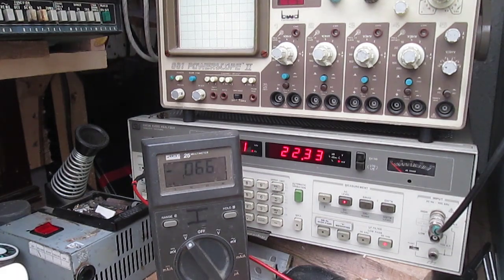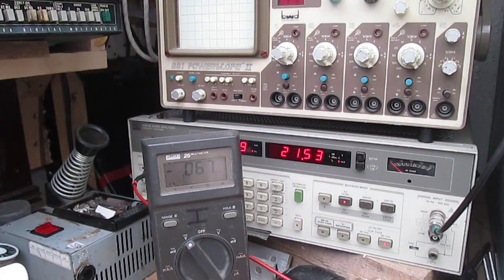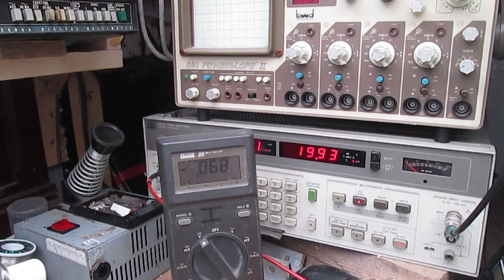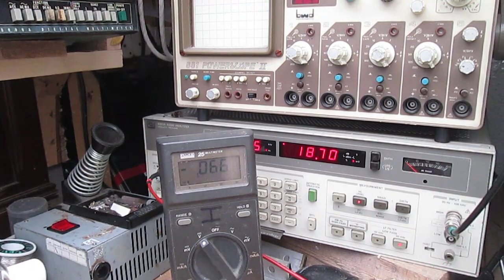As you can see, the back pair of 807s are now out of balance. If you're not careful you can go around in bloody circles - it's a bit like lofting a boat from plans, you can go round and round. Hopefully getting the balance of the amplifier in perfect balance between each output valve. So it's a bit of a nightmare. We've looked at DC balance - why don't we have a look at AC balance?